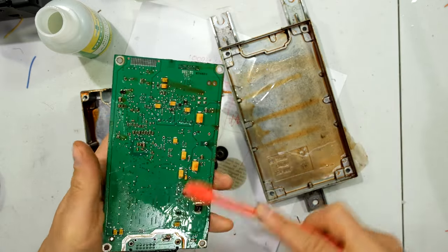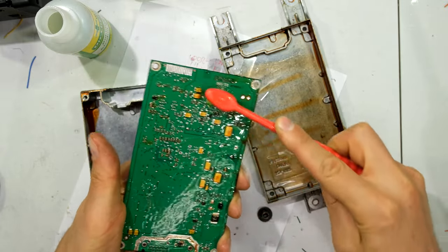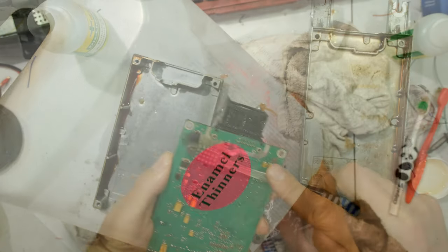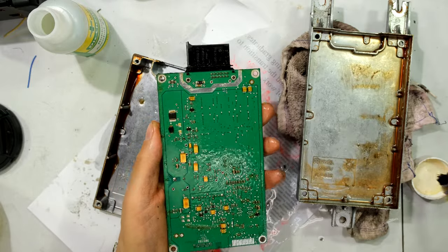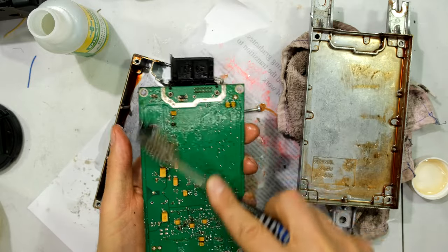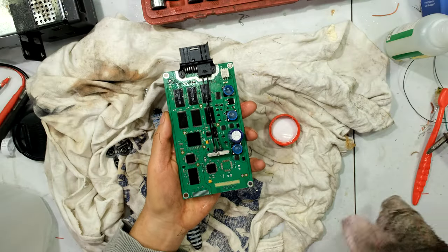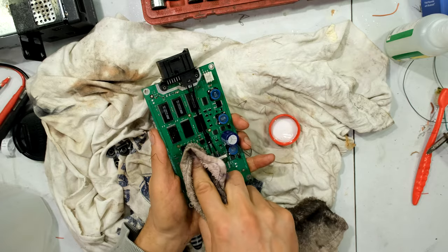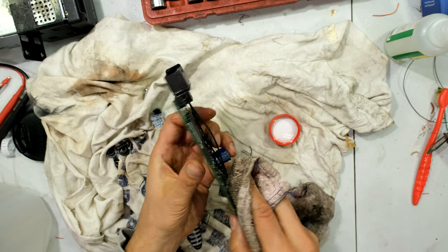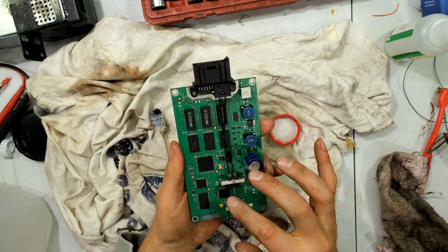Getting that oil off — it's actually sticky everywhere. You might even have to use some thinners. Enamel thinners are the best to dissolve oil that has leaked on the board. Give the thinners a bit of time to work — I put it on very liberally, drenching the items in thinners. It's important to take a cloth and just dab it, because you have to suck up that dissolved oil otherwise it's got nowhere to go. I'm just dabbing, not wiping.